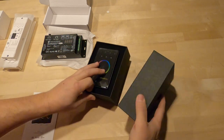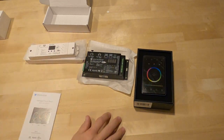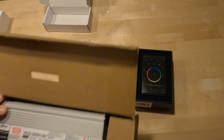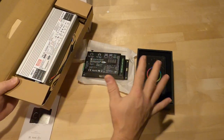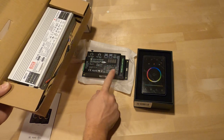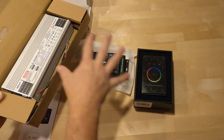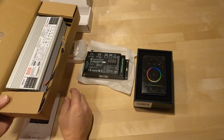Last part of this video — I'm not going into any install stuff on this — we'll do a video with these three things fired up with one of the big monster Meanwell power supplies. We'll do a video showing these three things integrated into a super nice, simple, easy-to-use DMX lighting controller. And then as an added bonus, you can take an Artnet controller and plug this in. If you want to do RTI, Crestron, Control 4, you can use Artnet commands and run this whole DMX as a package for a super simple and honestly low-cost system to get ultimate DMX 512 control.